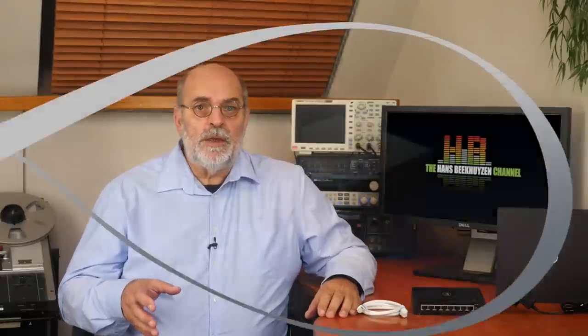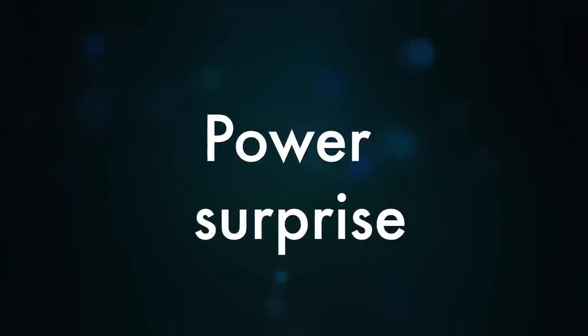The electronics inside the 8-switch are the same as in the Silent Angel Bond B8, yet there are clear differences between the two. The 8-switch has a machined aluminium housing while the Bond B8 uses folded metal. Especially when using very high-spec crystals, a solid housing can make a clear difference since crystals are rather microphonic — sensitive to vibrations. The second difference is the power supply: the Bond B8 comes with a medical-grade switch-mode power supply, while the 8-switch comes with a multimedia-grade switch-mode power supply.